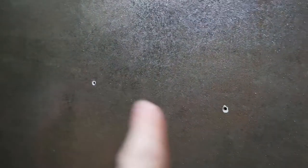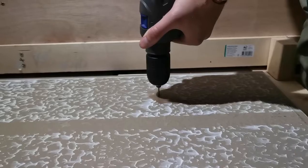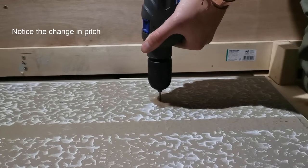One, two, three, four — the first hole is the worst looking one. As I went along it seemed to get better and better. That ends up with a finish like that — that's perfect. Now I'm going through with the 10mm bit coming from this side, so I should put a bit of tape on to help reduce chipping, and again oil or water to keep the drill bit cool. I'll punch through those four holes and hopefully we can get it bolted through with the log burner in position, which will be really exciting.